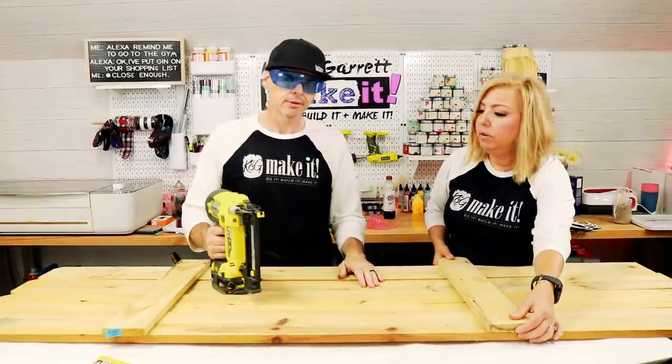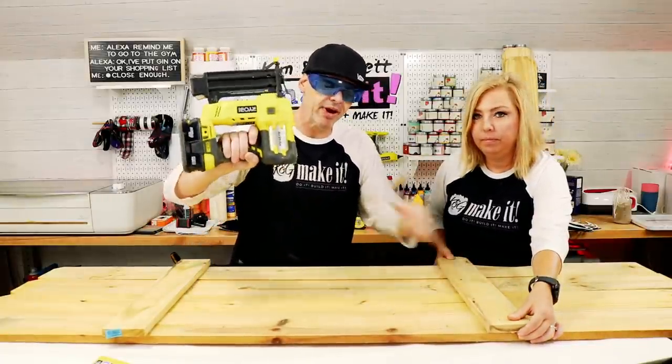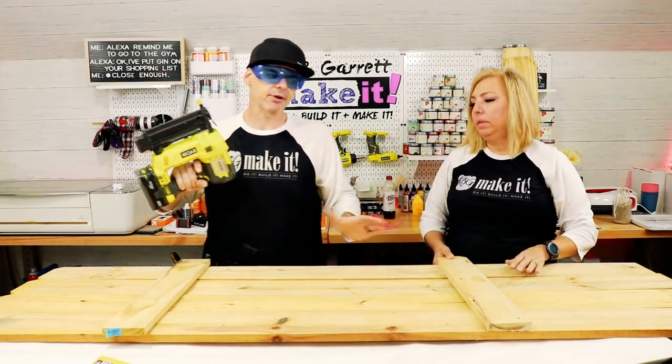Okay, so these are hanging over. Does that matter? Nope, we're good. We're gonna nail these with a 1 1/4-inch brad. The nail, not the guy. But I'm gonna try to stay away from the edges because we're gonna trim it down here in a second.